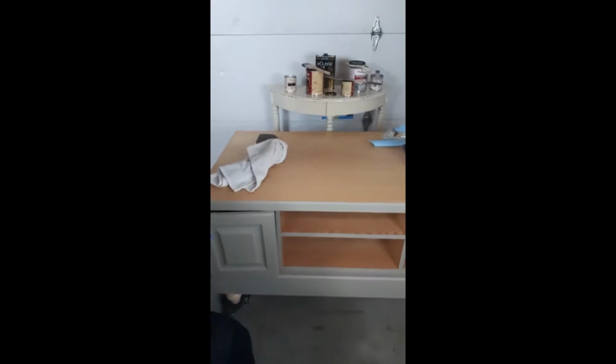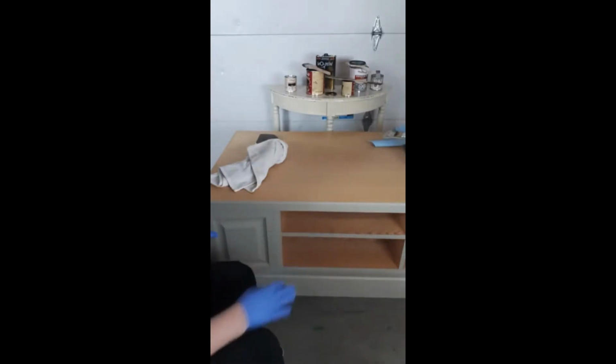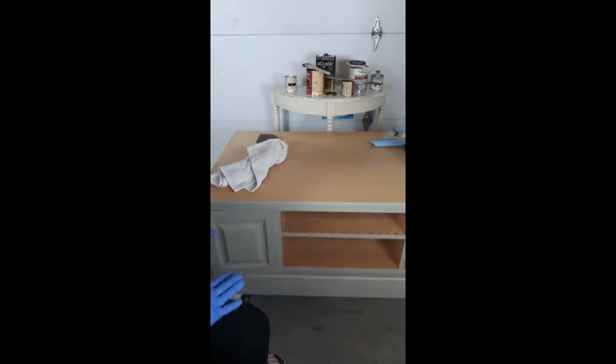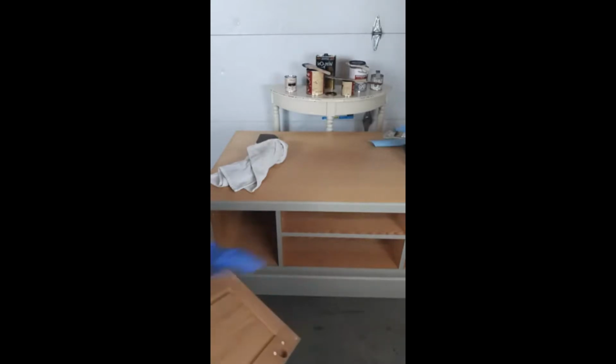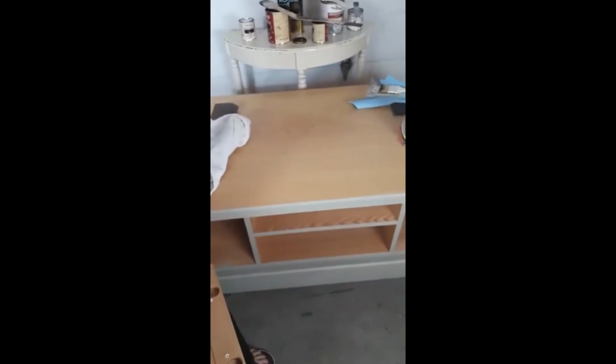They're going down here like that. So then you'll just have these two open shelves that I'm going to stain inside. I probably am not even going to stain the walls of the inside. I'm just going to stain the shelving a little bit darker, and not even a ton darker. I've already put one really light coat of darker stain on here, so you can see this is a little bit darker from this. But look how blonde this is. I mean, it is really, really blonde.